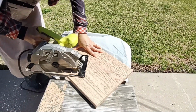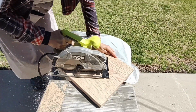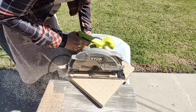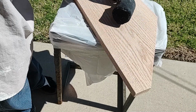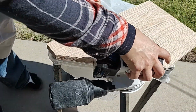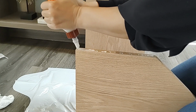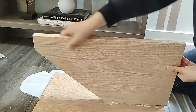Finally, let's move on to the creating part. I started off by making the legs. I cut off the triangle shape with the circular saw, since a lumber shop doesn't cut irregular shapes. I sanded the lumber with 60 grit for rough surfaces, then 220 grit. I also sanded lightly at different angles to round out the sharp edges. Then I glued them together with Gorilla Wood glue and let it dry for a day.